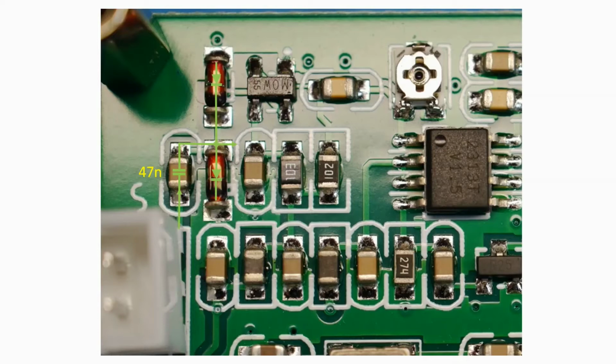This is a multi-layer board, and it's been quite difficult to work out exactly where that goes to, but as you're going to see later on, this thing will work with less than 1 volt peak to peak, or you can increase that, whereas the earlier one needed, I think, about 5 and a bit volts before the peak would start reading. So I'm pretty sure that the dual op amp chip there is acting as both a buffer and some kind of input amplification to drive the PIC, which is quite good. Right, let's go and have a look at it connected up on the bench, see what results we can get.